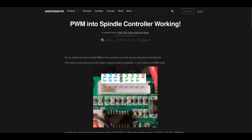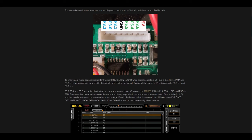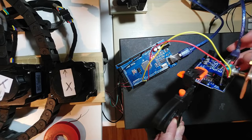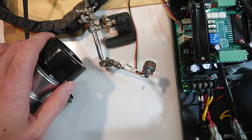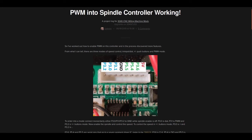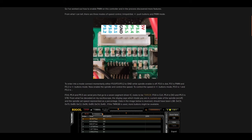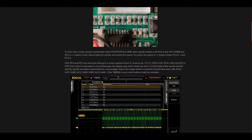The Hackaday.io project shows how to change some settings of that controller — for example, making it listen to an external PWM signal or changing the ramp-up speed of the spindle. I have a PWM input connector on my board that I will try out in my next video. I am planning to add Arduinos to my control box anyway, and the idle one could do the job. The existing PWM signal sounds just awful, so a higher or lower PWM frequency might be better for my ears. Although I am still not sure whether I want to use my own PWM control, since the microcontroller provides extra functions such as limiting the ramp-up speed, which I would have to handle myself.